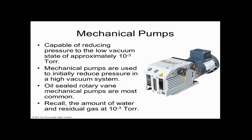And this pump will go down to 10 to the minus 3 torr. And that's good, but at 10 to the minus 5 or 5 times 10 to the minus 4 torr, that's when we peel off all the water vapor. Water would sublimate off the walls in a vacuum system. So we like to go to minus 6s to make sure that we get all the water out. So if we had a tool, let me go back to this drawing